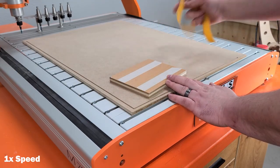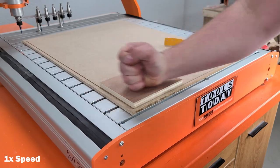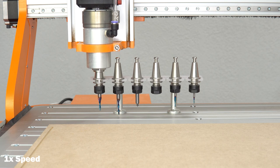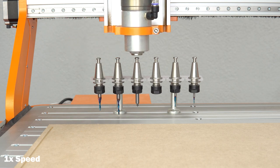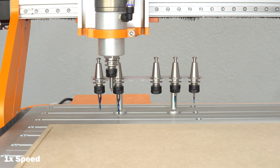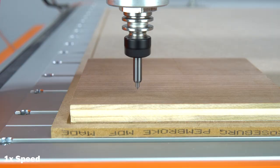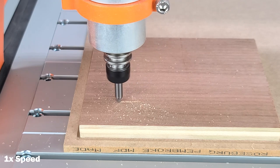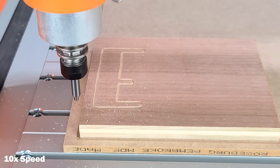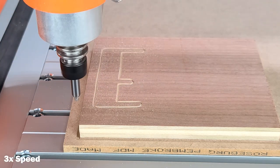I realized I was using a tool I had never used before — the small 1/16th inch radius point round over bit — so I wanted to make a test piece to ensure I get my settings right before cutting the final piece. This is one of the few CNCs I've seen with an auto tool change on a desktop size machine — it uses pneumatics to pick up and drop off bits and it works really well, speeding things up drastically with multiple bits. I accidentally set the Z zero position a little too high, so I did a second pass after dropping the Z position lower and got a perfect result.